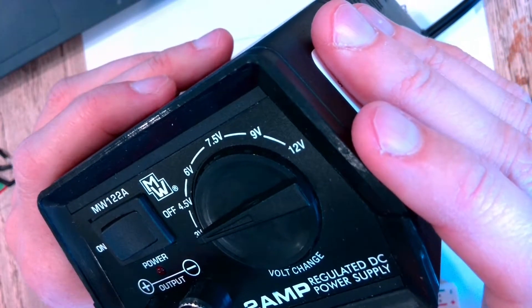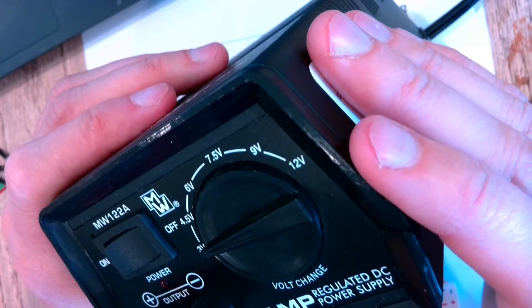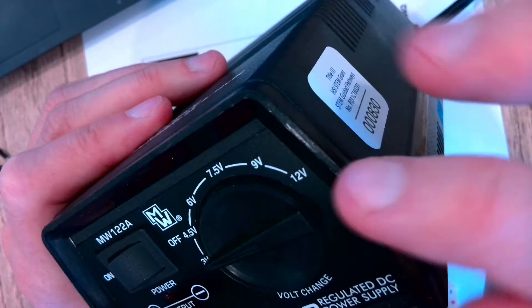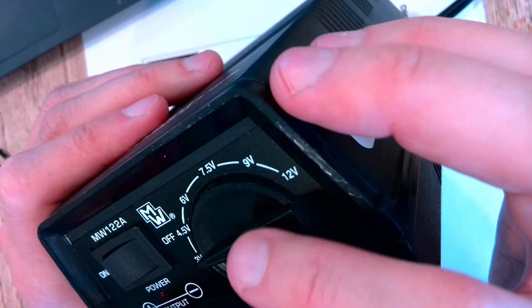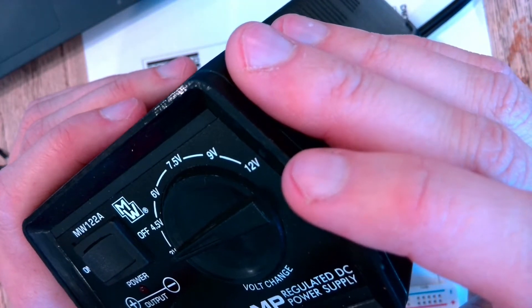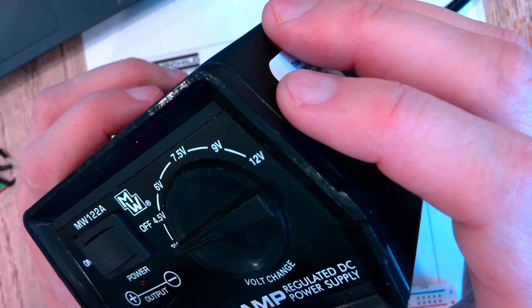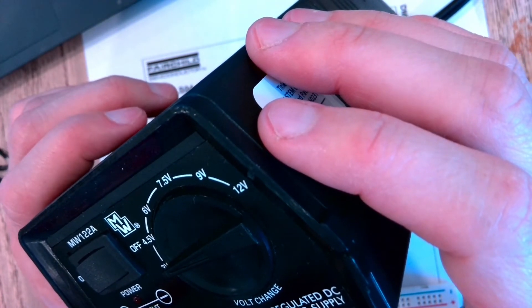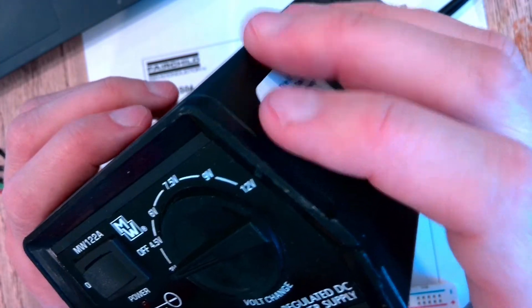Optimally we'll usually apply five volts as our high signal — 4.5 volts would work too. Six is getting a little bit high, so we'll stay away from higher voltages because we don't want to risk burning anything out. We're also using an LED, which is pretty low current and fairly easy to pop if not connected correctly.